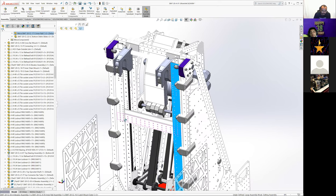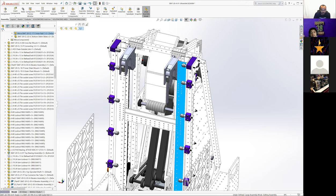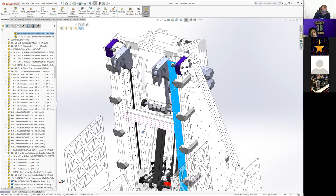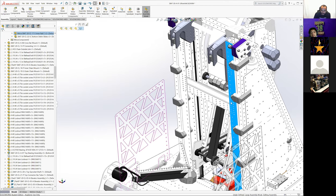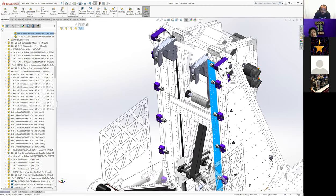There's probably versions of this that get a lot lighter and easier if we had just done it as 2x1. But with 2x1, you're limited on how you can mount to that side rail again with the bearings running across it and everything. So we were a little worried about some of our bearing placements and things just not getting exactly what we wanted. So we just did it out of sheet metal. It worked well enough. It was heavier than it probably should have been, especially once we got rid of the buddy climb, you just don't need it to be nearly as stout as this version is.